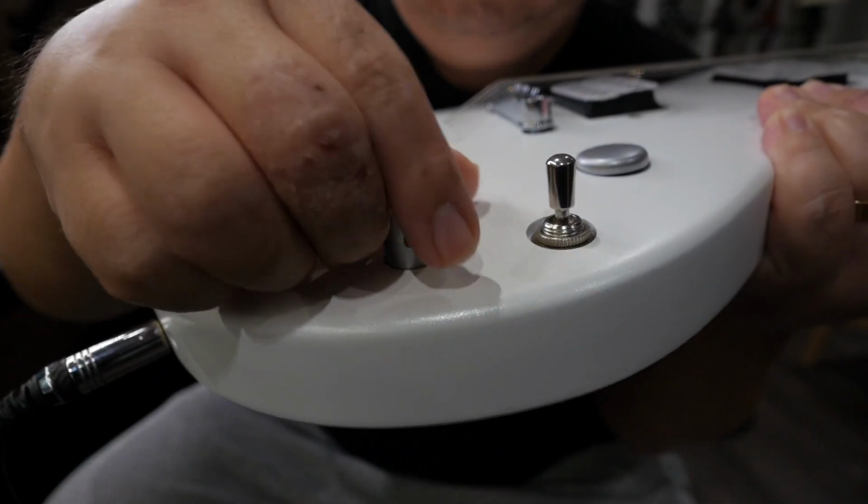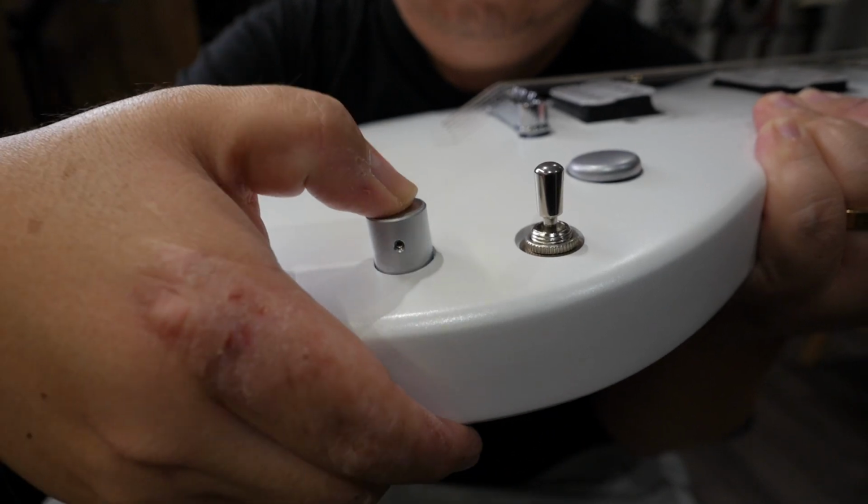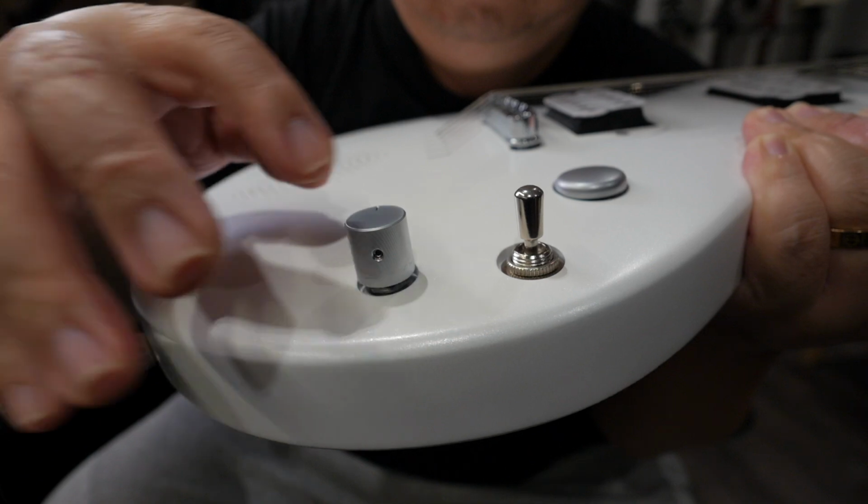But there's more. This pickup volume knob is also a pull switch that turns the neck pickup from series to parallel connection. It's a way of making it more single coil-like, but without the accompanying hum, and I think it works well. So you have an extra flavor of neck pickup and an extra flavor of the middle position.